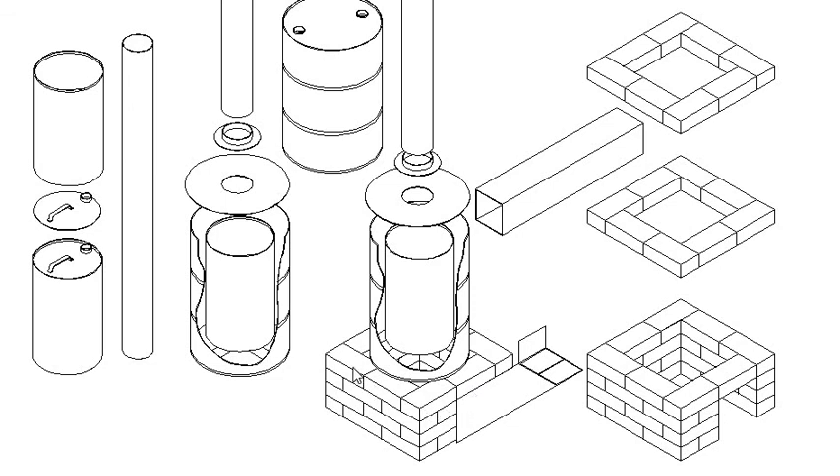Really it's just about getting that air inlet opening to balance with the flue. What I'll do is build it above ground level first, get it so I'm happy with it, and then once I refine the design I'll sink it into the ground. It might be worth having a few extra air passages going in, and possibly one on the other side as well, just to be able to control the burn a little bit more. Anyway, thanks for watching — I've got another couple of ideas and I'll post similar drawings of those on YouTube as well.